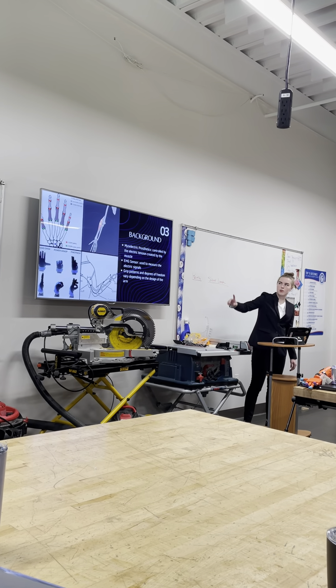If I were to do this project again, there are a few changes I would make to produce a more accurate prosthetic. One change would be buying a different sensor — probably an armband sensor because there are more connection points to read the muscles. Another change would be moving the channels that the fishing line runs through, because the current placement prevents the hand from fully forming a fist. This would allow the hand to complete more precise movements, like holding a pencil. Adding wrist movement would also allow the prosthetic to act more like an actual arm by adding both rotational and bending movement, enabling more complex tasks.